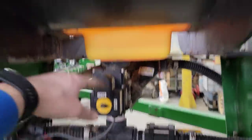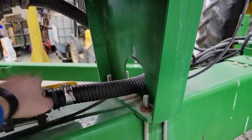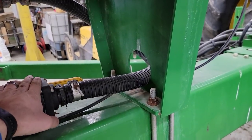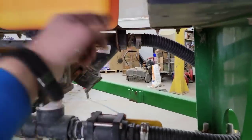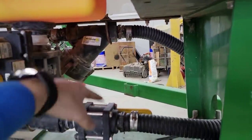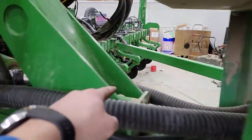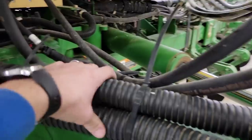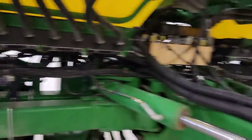When we want to empty the tank we open this valve and it goes through to the pump. There's also a valve to shut off if I need to clean the filter, otherwise it would drain the whole tank. This smaller hose is inch-and-a-half and the big one is two-inch — it goes back over to the pump. Fairly simple on that end.